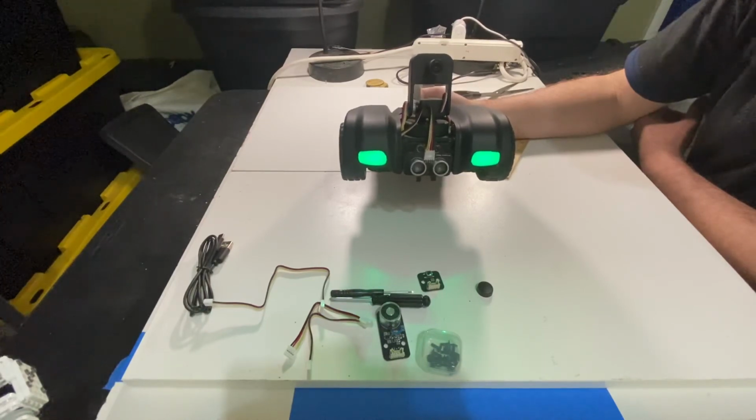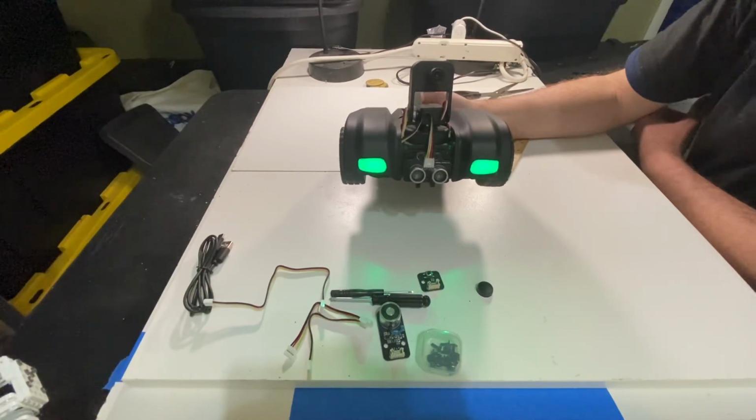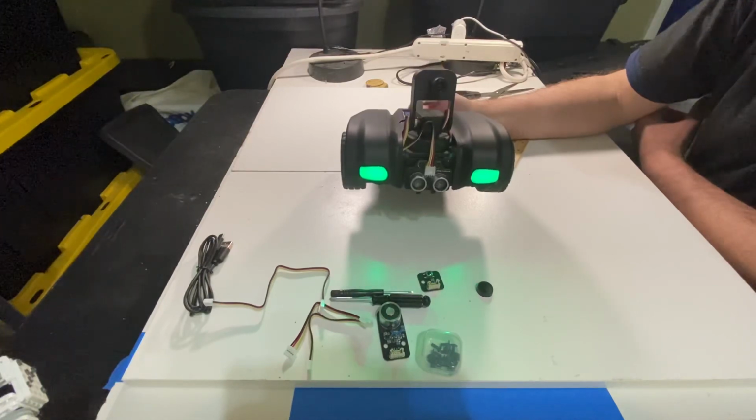So the biggest issue I was having was connecting the camera to the board. So remember, flip it up. Don't push it in. Flip it up, and then flip it down to lock it into position. Just try to be careful with the cable. Not bend it too much.